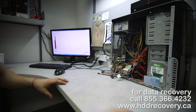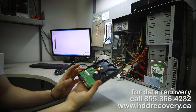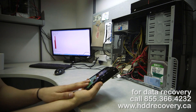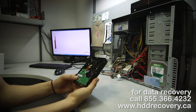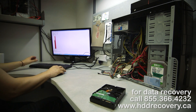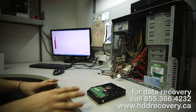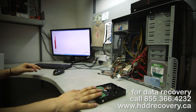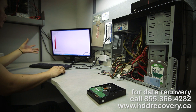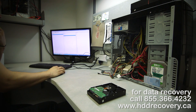I'm going to power this off. We have a donor here — this donor actually has dead heads already, we tested it, so we don't really need it for anything specific. This is going to be our donor device. I'll explain a couple of ways this can be done: it can be done in hardware if the drive has an external ROM chip, or it can be done using this utility — PC 3000 in this case. We have to go vendor-specific on this one.